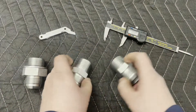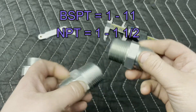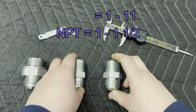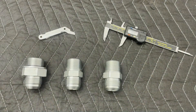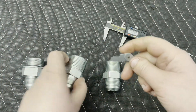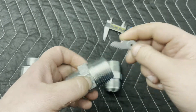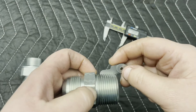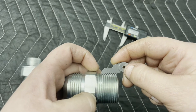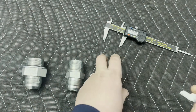How to tell the difference between British and Standard Pipe — you can see when you put them up next to each other, they're super duper close. The threads are not very far off from each other, so I have this handy tool which you can pick up super cheap at any store: the Thread Pitch Gauge. That's an 11. You can see how it sits down nice and tight in the British, but when you try to put it in the standard, you can push it down but it just doesn't want to sit properly.